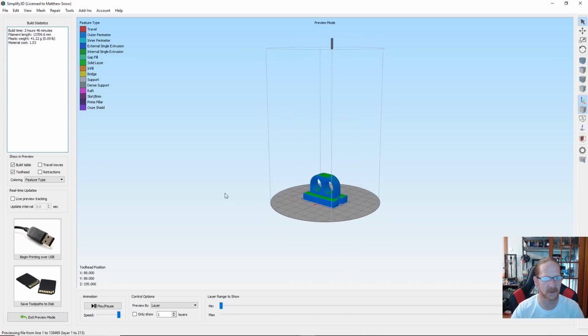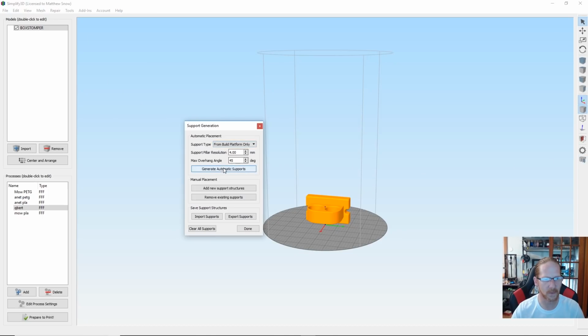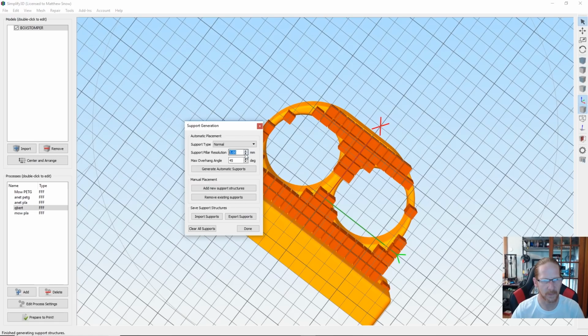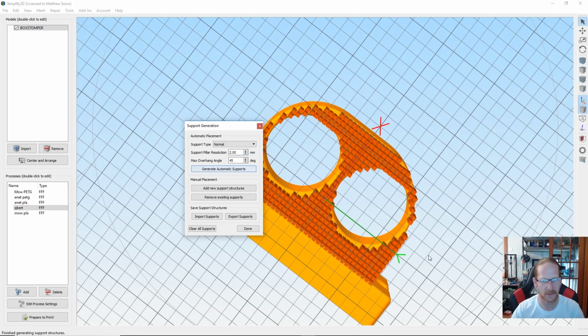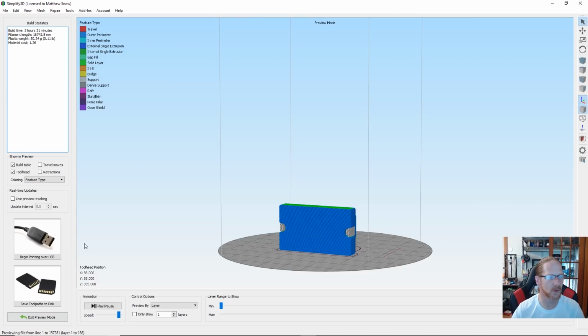Okay, let's see what's what. I just want to see how long the whole thing's going to take. Let's orientate it the right way. Control L, select the surface, center it, support material from the build plate only, generate, let's go all, make them a little smaller, make them a little smaller. I don't know about this area right here, why it won't put support in there. Unless I go all the way down to 1. We're going to go there. 3 hours and 21 minutes.